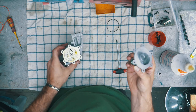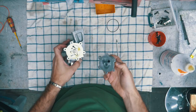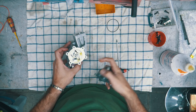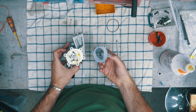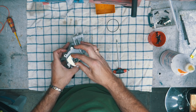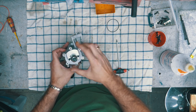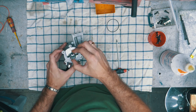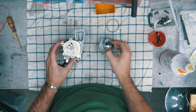Now for the end cap. This is very, very crucial. There is a cut-out here and there's a cut-out on this side coming from the oil pan itself. I thought this thing could only go one way, but as you can see some holes don't align — it aligns like this, and that's actually the wrong way.